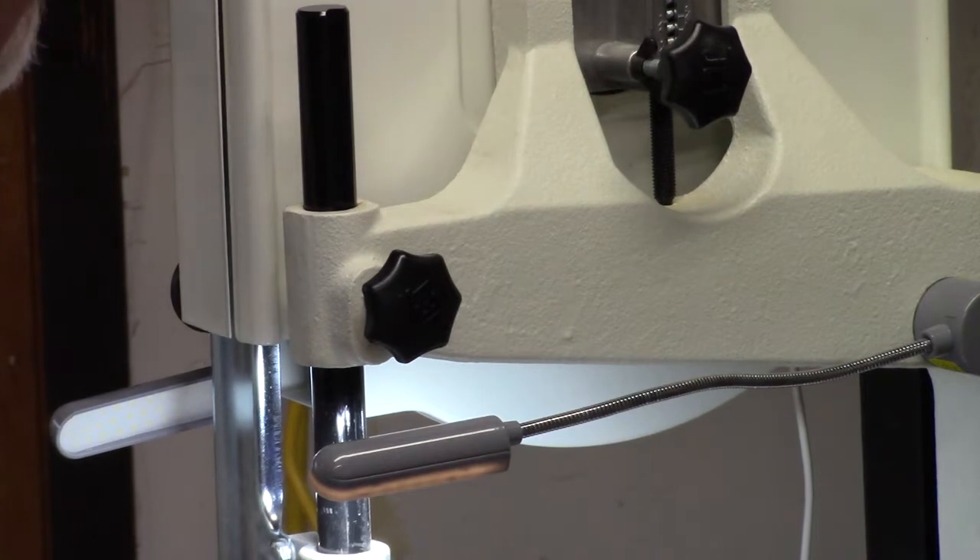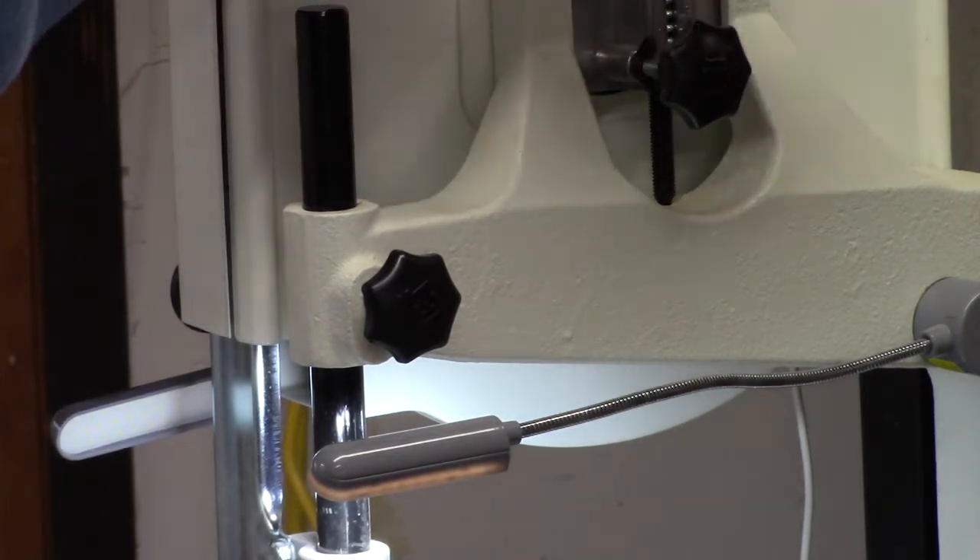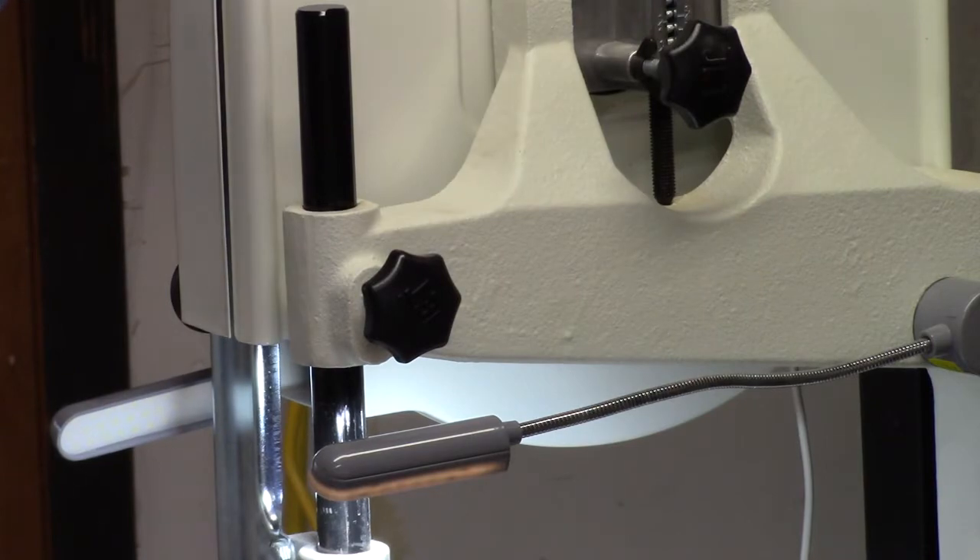The Jet has a little divot in there, so when I tension it up it stays right in place and causes me a lot less grief. The tires were getting old on the old Delta and that was also causing the blade to jump into a groove. So tensioning the Jet is a snap — I don't have to think about it walking up and causing trouble.